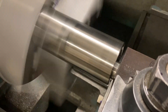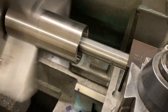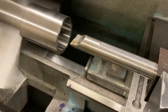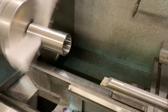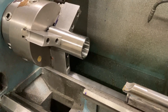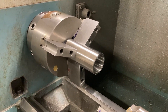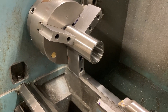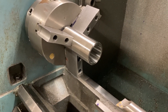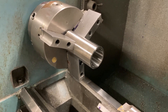That's just about done — that's why we leave a little extra. The boring bar backs away and comes out. Now we're going to check it with the ball mic — I need two hands for that. Titan Machine Tool signing off. 316 stainless steel housing for a cutlass bearing, marine application. Signing off.